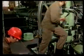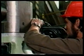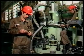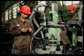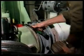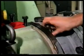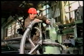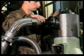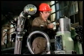The engine is drained of cylinder cooling water, according to maintenance manual, group 270, sheet 1. Protect pipe connections from dirt and damage. Also, this ball seat must be treated with utmost care to avoid damaging its surface.